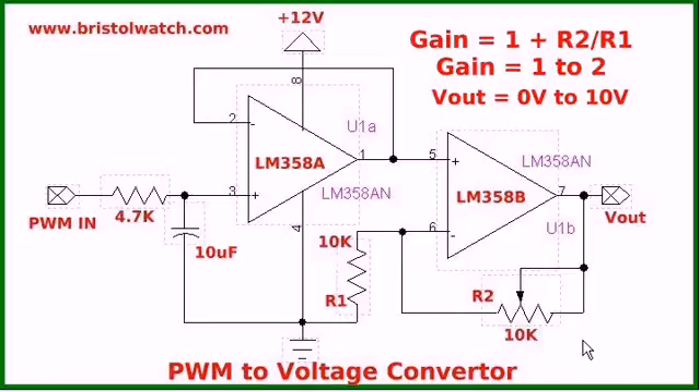So now I have a range of 0 to 10 volts at a 12-volt supply. If I was to go to 24 volts, I could adjust this or change the value of this pot and change it where I could adjust it from 0 to 22 volts. This greatly would extend the range of the 0 to 5 volts normally seen in the Arduino.